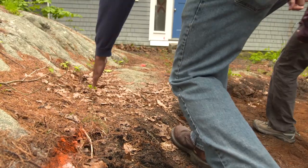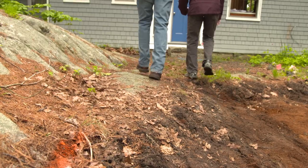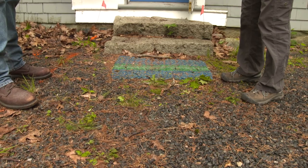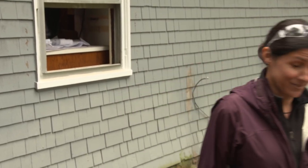The side of the garage follows this orange spray line all the way to this point here, which is the back corner of the garage. We're going to carry that same line hammering down the ledge to set our footings into the ledge. And Jen, you're actually standing in the middle of the mudroom right here. In the mudroom, I actually want to go down about three feet clear space finish for our mechanicals to fit. Well, let's get this process started. I cannot wait to see it. Let's go.